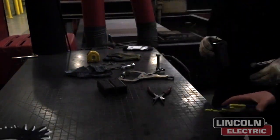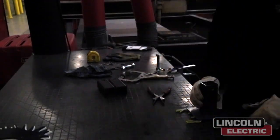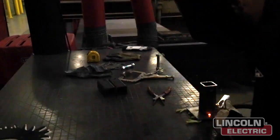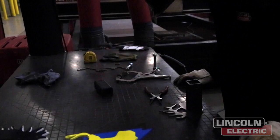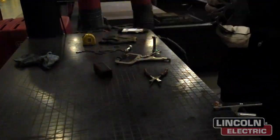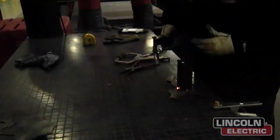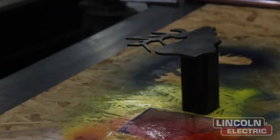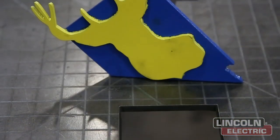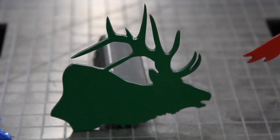Now in the final step, we're taking that square tubing and tack welding the design onto the very front. If you're tack welding on a painted design, just make sure you have good solid tacks. With the design in front, you won't see any heat-affected zone on the very front surface finish. On designs where we have a single color of paint for the hitch cover, we're able to just tack them and then finish them off with spray paint as our final step.